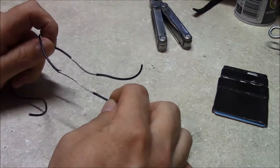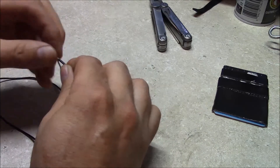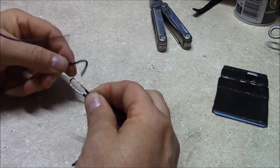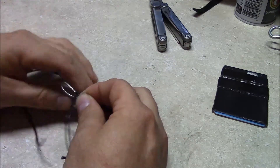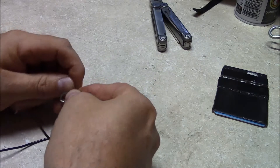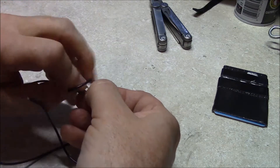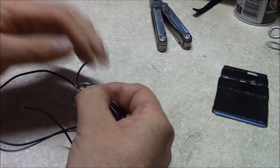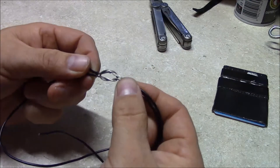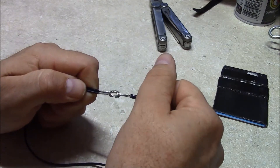After you've prepared both of your ends of wire, make a simple square knot. The way I do that is make a bight in one of my wires, feed my other one through, run it around just like that — using the insulation as a guide, making it even on either end, and then just drawing our knot down.